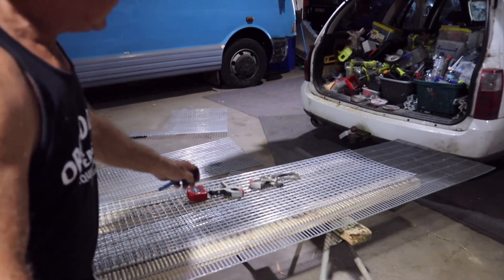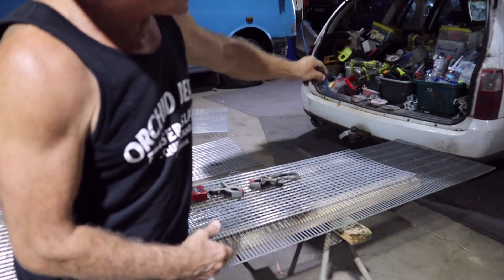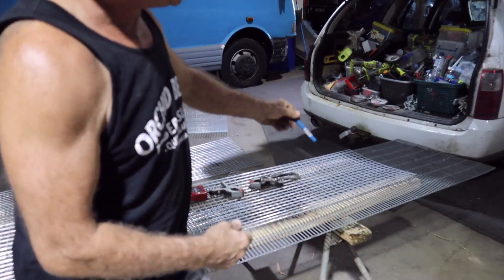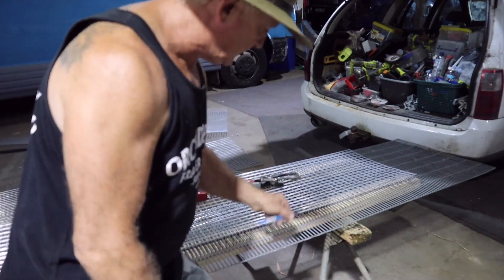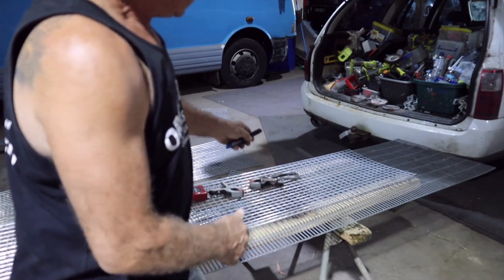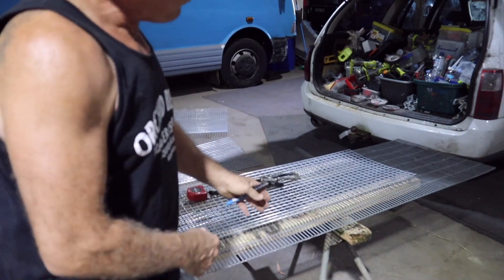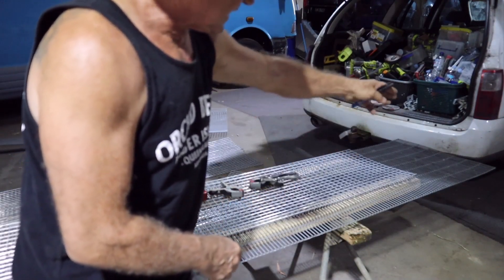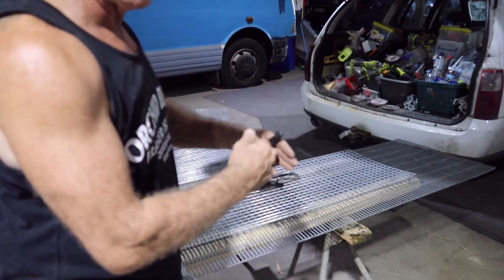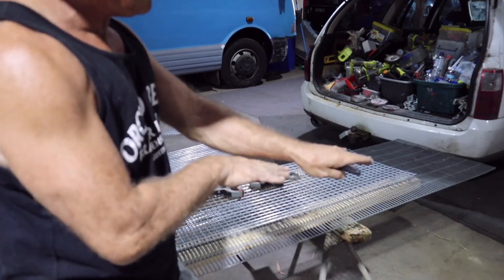So at 950, because of that, I've moved it with 400 each end hanging off the end. The reason I'm doing that — I'll add a little bit on each end. I don't want anything joining in the same spot. Some people might just go with all these wires 3 meters up here, 3 meters up there, 3 meters across here. Then you have joins and it's going to get floppy. I'll make that one 400 off each end because that'll be the back. The front will run an 800 piece and a 3 meter piece. But when I put the top on, I'll move it so that it doesn't join over the same line — just like you do putting timber down, you stagger them, you don't just have one big line across.